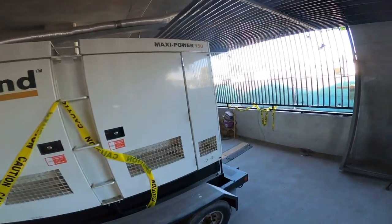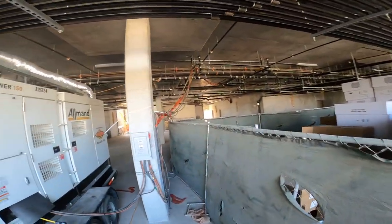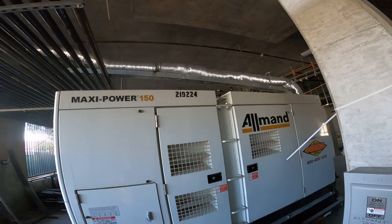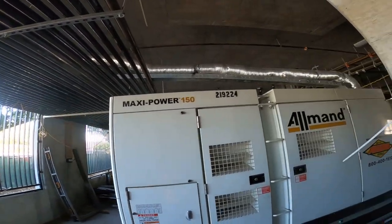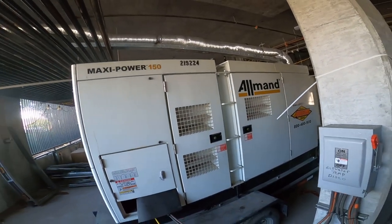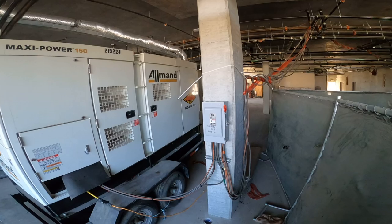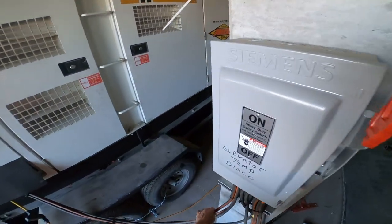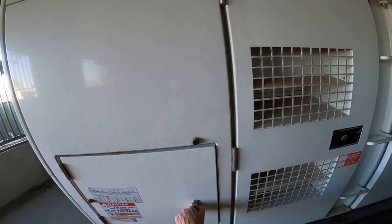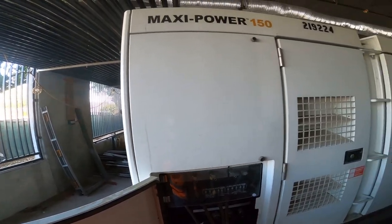When I was at CSI working out at Lockheed Martin, I had hooked up a generator that was twice this size - exactly for testing all the overhead cranes and power systems inside one of the hangars. Those things are massive, I can't even tell you how many tons they carry. The cables were bigger than this. This is running on 480 and we just hooked them underneath the lugs, and that was a problem. We had to find connectors for finely stranded wires.